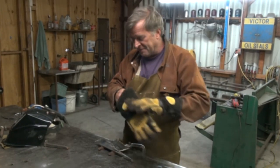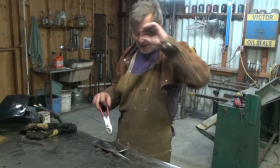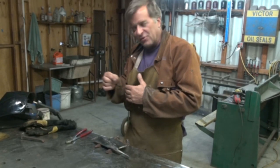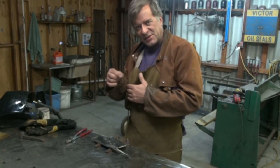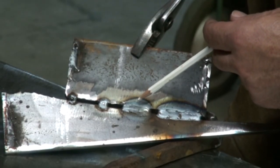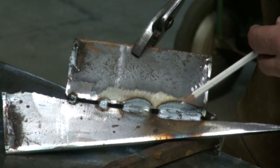So let me just get another little run right there. I'm going to start on this end and go back the other way. That actually worked okay. Turned it down just a little bit more — same wire feed — ran a nice little bead, filled it in nice. I got a little bit of a gap opening up, and I could just weave back and forth, steal a little from each side to help fill it in. Worked really nice. So this first one I did at 21.5, and then this one I just did at 21.2.